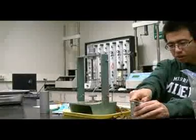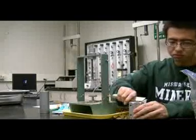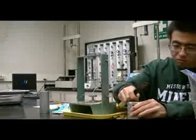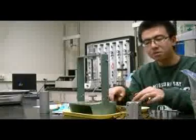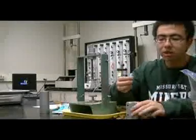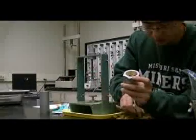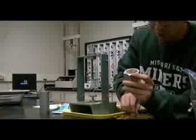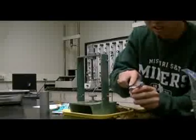This side we also have to smooth the surface. Sometimes you will see some gravel trapped right at the surface of the specimen. We have to take off the big gravel and do some patching work — put some soil back to fill the hole where we took off the gravel, and then use the knife to compact it and smooth the surface.